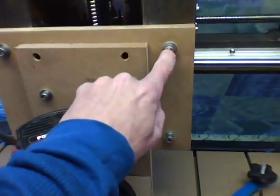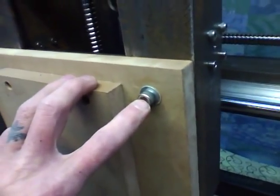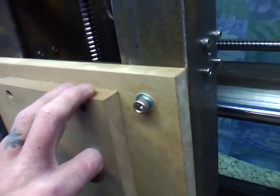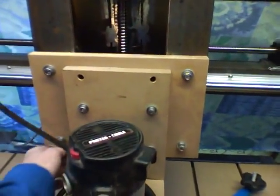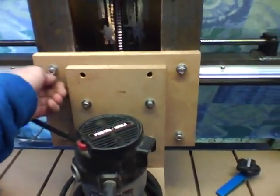These 5/16-inch bolts are going through double-thick quarter-inch and quarter-inch steel — basically a half-inch deep tapped hole that these are threading into. It's just meat. I'm going to make a plexiglass template with these bolt holes in the pattern, so if I ever need to make new plates I have a standalone drill pattern to match this.